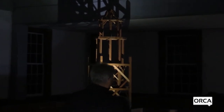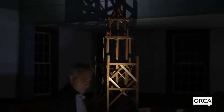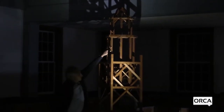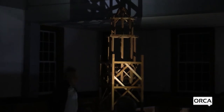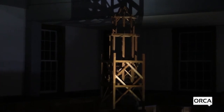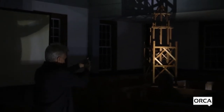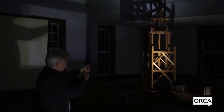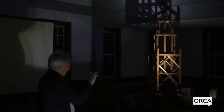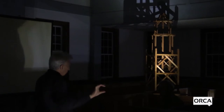Then we actually can sort of be inside and play with flashings and things like that. And I actually want to take off some of the corner boards, one of these lower columns, or octagon columns, because this thing has a very unusual feature also. The inner octagon, upper one, has a through mortise to the mast, then there's through mortises through the inner octagon posts, then there's mortises in the outer octagon posts, and there's a piece of 1.5 by 5 that runs all the way, transfixes all of them.